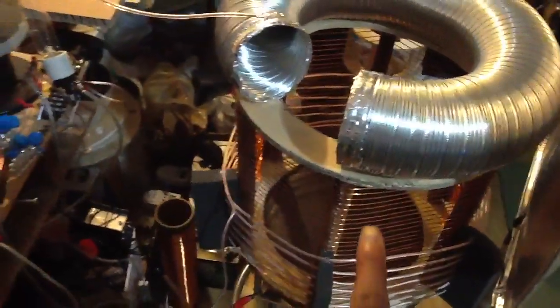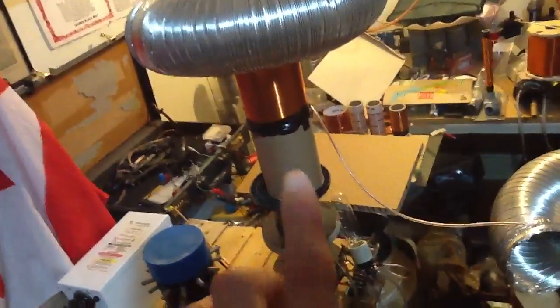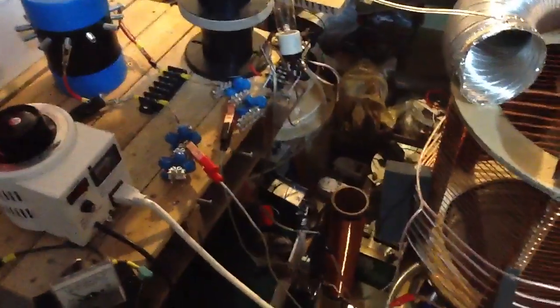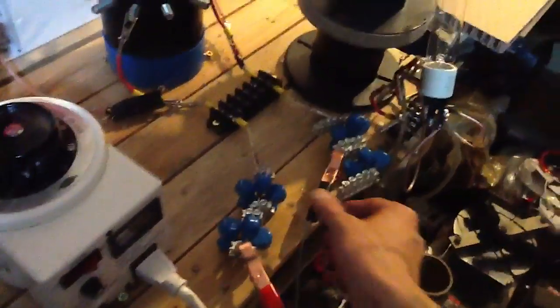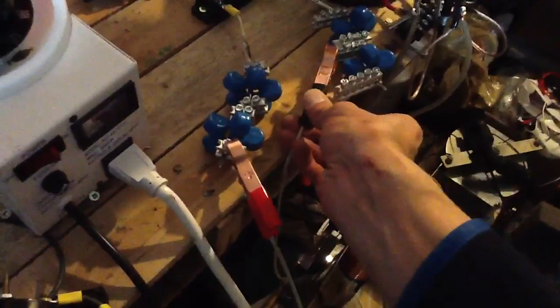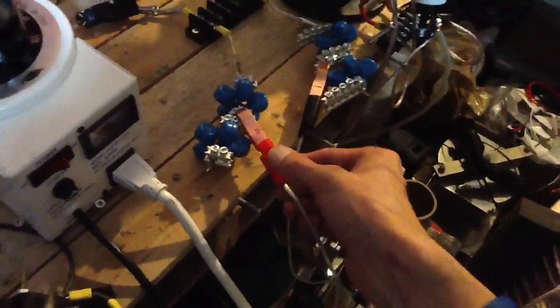So this being the master oscillator — primary, secondary — and I'm actually out of turns on the primary. I think it can still get better just by having another turn on the primary, or I'd have to rearrange all my capacitors, maybe take one out of the bundle. I had been experimenting with half the amount of capacitance by doing that — putting more in series, which cuts the capacitance down in half. But then I get to one turn and it still gets better and better, so I'm going to have to just figure out the right top load dimensions.